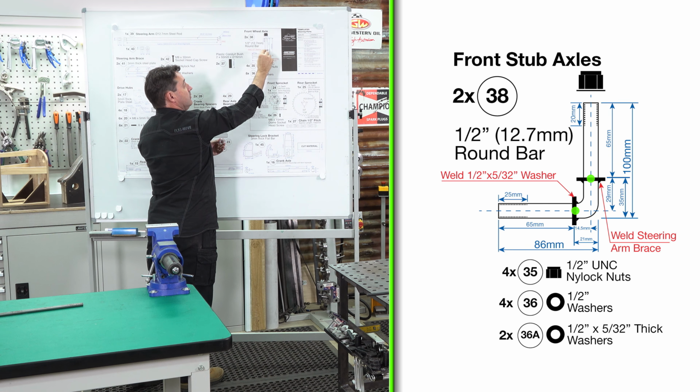We then use a leverage bar over the outside, and we can then start to bend incrementally until we get our 90 degrees. Small movements will keep the radius tight up against the face. Don't let it slide out, otherwise you'll create a bend out here. We want the bend point right there. We're spot on.